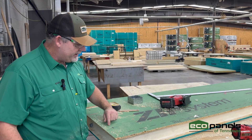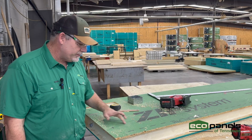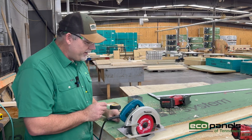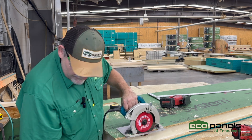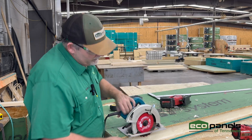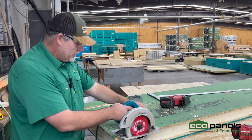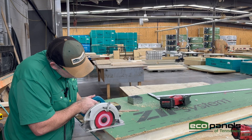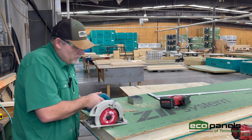Gunner, come up here and help me. Did you cut this out with a skill saw or a jigsaw? I done a skill saw. Alright, so for the long cut we could use either one here since we're just going down about a foot. But if your raceway went all the way up top, you'd want to use a skill saw. All we're doing is cutting a trough. You set your saw blade depth — move it up or down, whatever you need. Have it unplugged first. Once it's set deep enough, go right there, then plug in the saw and cut along all your lines.